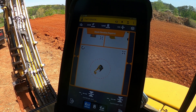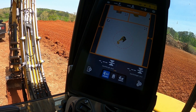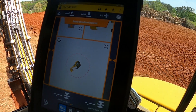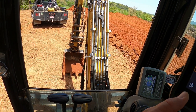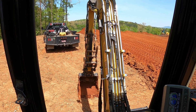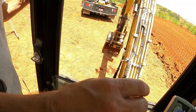Now the machine is ready to set up. What we're going to simulate here is digging a 12-inch footing for a house. There's a setting where you measure by the teeth, so you take the teeth and touch them on the ground — straight up and down. Level the stick and there we go — teeth on the ground, that's good.